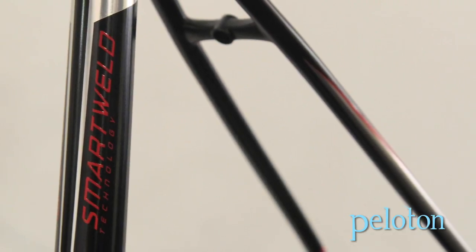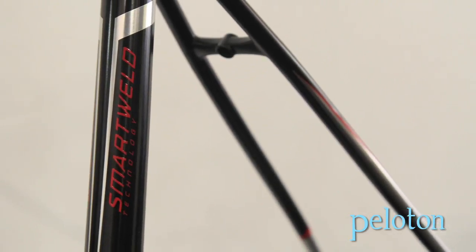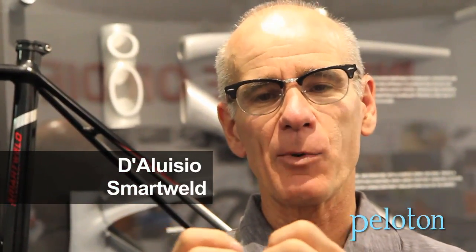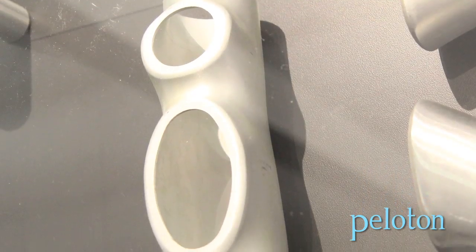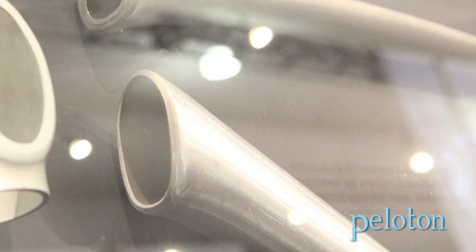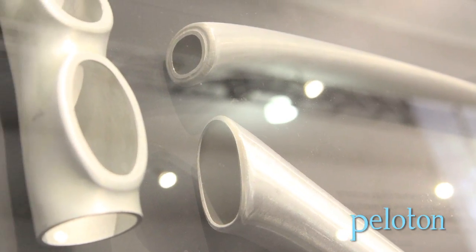What we've developed here with this new Deluzio smart weld technology — we have used some geometric advantage by rolling the ends of the tubes at the connection point. We create this stiffened structure because of this rolled edge. This rolled edge meets another rolled edge section, and this creates a little valley for the welder to basically lay his bead and his material in.